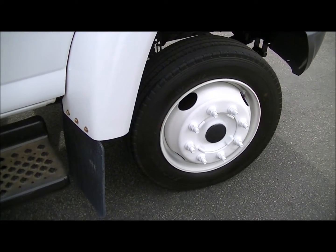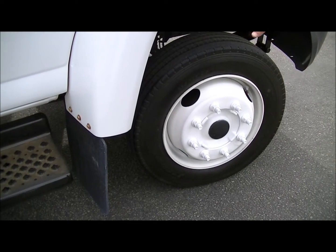One of the things you always have to remember is that the truck has been tested from the manufacturer based on everything being standard, so tire pressure needs to be good. They tested on a 5-degree slope for the weight of the bucket, so keep that in mind when you're setting up your truck. If it's on flat ground then it's good. So the first thing we're going to do is check the tire pressure for all the tires, front and rear.